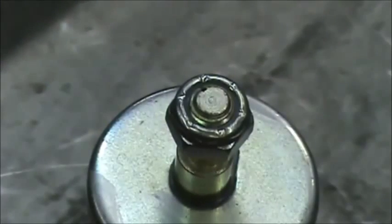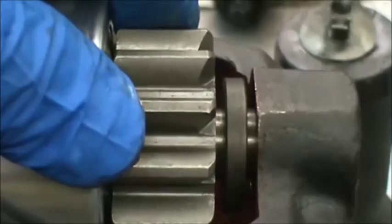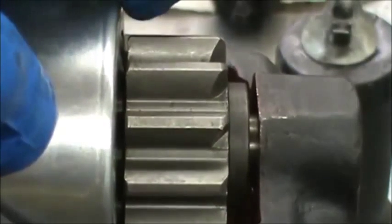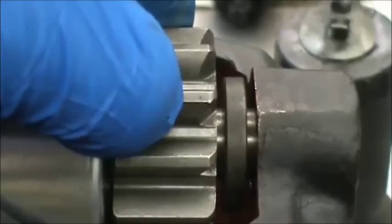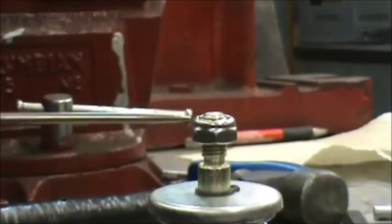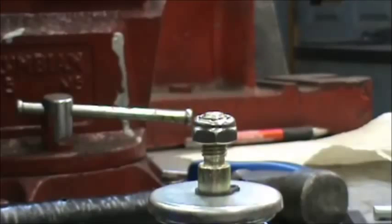The adjustment controls the pinion clearance — this distance in between the bottom of the stop collar and the top of the Bendix. You want it to be right about there. If it's too far back, the solenoid might click and not kick in; if it's too far up it wears into the Bendix and the stop collar and the solenoid doesn't properly function. The general rule of thumb: inside the lever housing, hold the back of the plunger with your hand and with a half inch nut driver tighten the nut down so that the top of the nut is flush with the top of the shaft, then continue tightening another one and a half turns — that generally sets the pinion clearance to where it's pretty close.